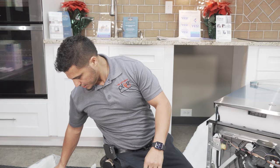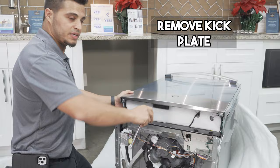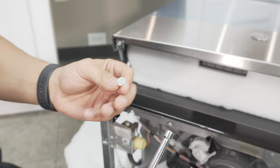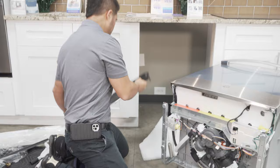First thing, in order to get to what you're going to need, start off by removing the kick plate — it comes attached. Just pop it off. You can use a nut driver or it's also a Phillips head, so pop it off with a Phillips screwdriver or a quarter-inch nut driver. I prefer the quarter-inch nut driver. So pop that off — there, kick plate's removed. Set that aside; we won't need that till the very end.